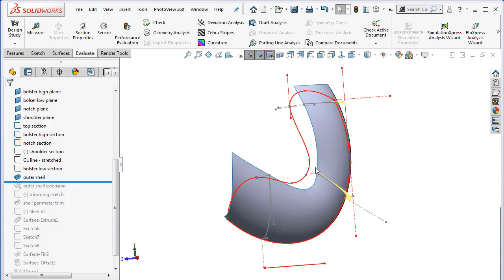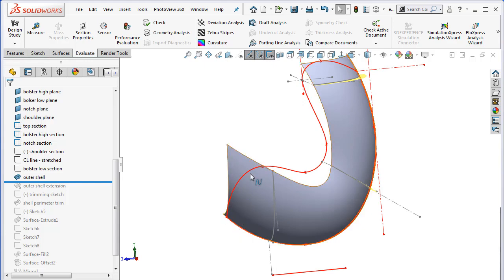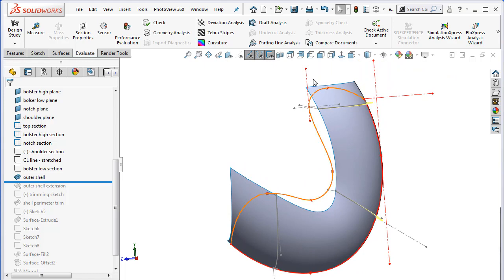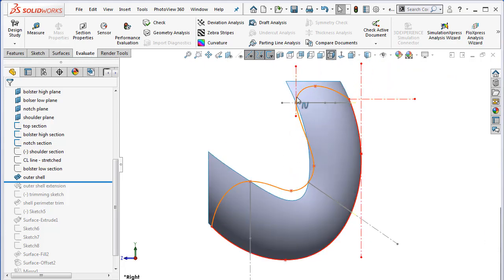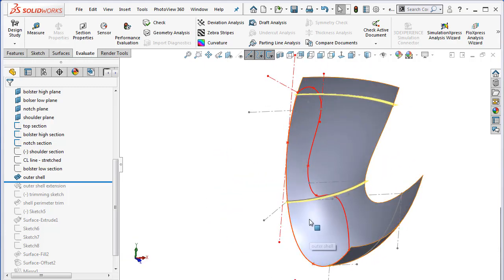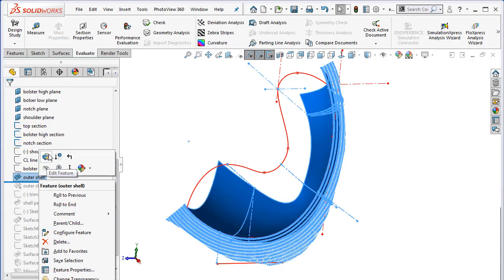And it looks a little funny in this area, and I purposely made it overshoot the end of the chair, or rather the front of the chair a little bit, and it's a little bit higher than the top of the chair. Now you see here that the perimeter goes out farther than the actual surface that was just created. I'll also mention, of course, that this surface has to be normal to profile on this edge here, and that's the only control that you end up making on this feature.